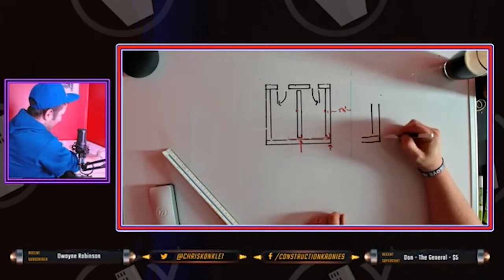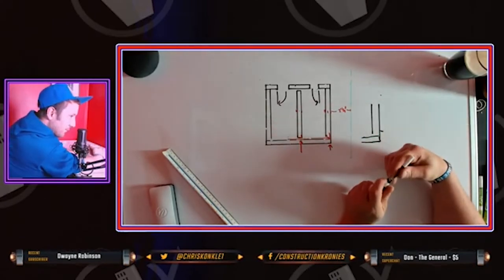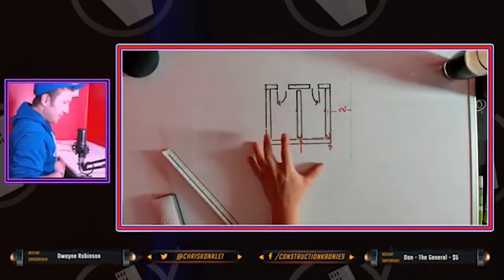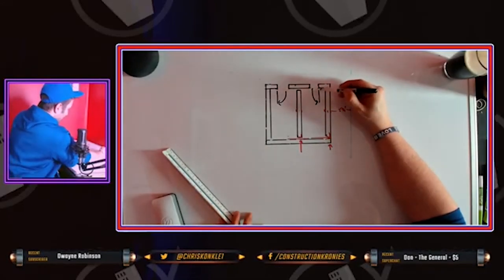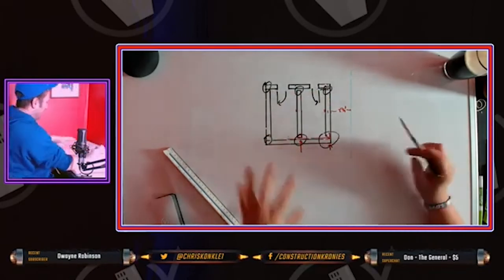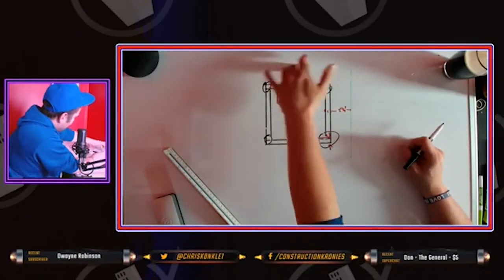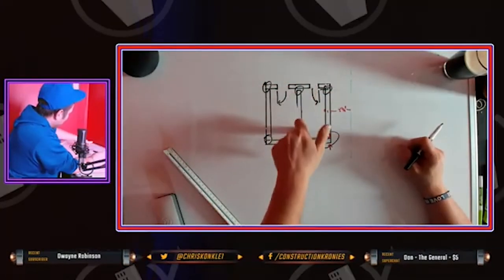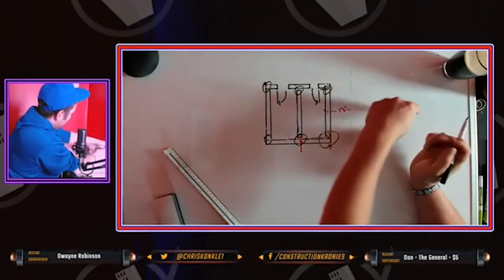I put a full piece in so that this is overlaying the bottom track. So anyways, you're going to have floaters here, there, there, there, and there — floating studs. You always drywall the inside first. That way you can insulate the outsides. Usually you insulate the outsides and maybe one side here. Or at the very least you insulate a whole room, skip a room, insulate a whole room, skip a room, insulate — think about that.